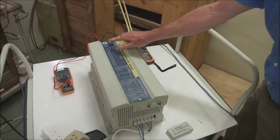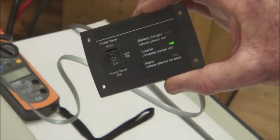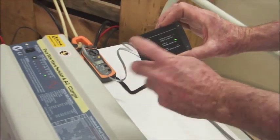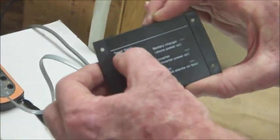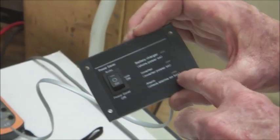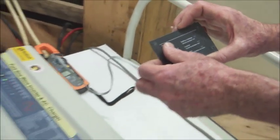The remote controller for the inverter comes with a lead — normally a 5 metre long lead, though in this case we've just got a short lead. The control here is exactly the same as the control on the inverter face: power saving mode off, the off position, and then power saving mode auto. It shows whether the battery is being charged, whether the inverter is on, and whether an alarm is on — which means you'd go back to the box and check. This is a wonderful feature and it comes with the larger units.